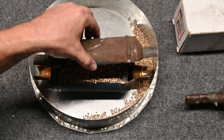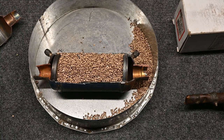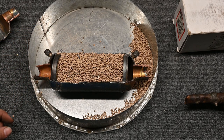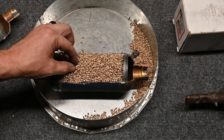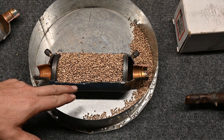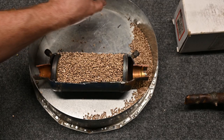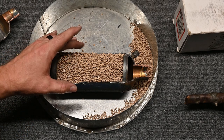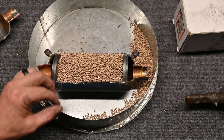If we take this cover off, we see inside that this one has these little BBs. These BBs, very similar to those in the liquid line dryer, are a desiccant material. Their job is to absorb moisture, and typically on the suction line they're more for acid than they are for moisture. Moisture control works really well on the liquid side, and acid control works really well on the suction side.